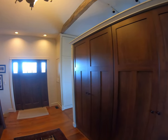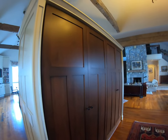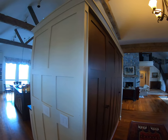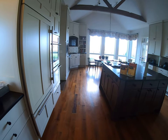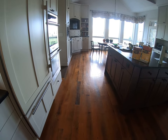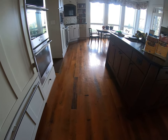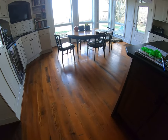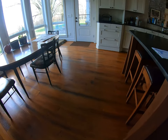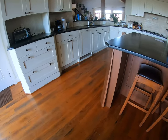Now here's some nice bookcases or cabinets — these actually have a lacquer finish, it looks like. But let's focus on the Waterlox. The Waterlox is a hardening tung oil. As opposed to a polyurethane, which forms a film and can be easily scratched, the Waterlox hardens within the wood.